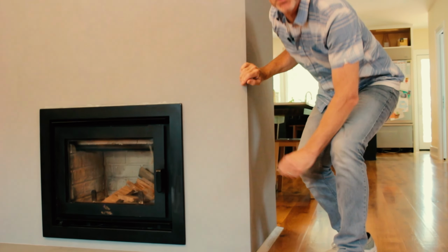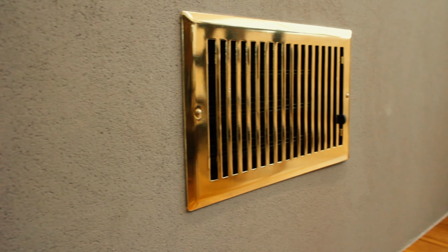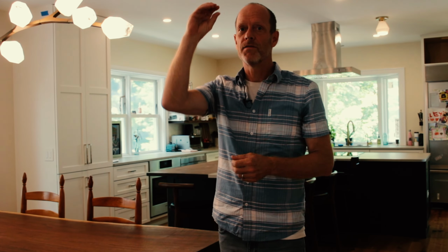Let me bring you into the other side of the room to show you the chimney venting. So the fireplace manufacturers recommend that you allow your chimney to exhaust the hot air that builds up in it through your roof. I decided not to do that. Instead, I created a pressure boundary by sealing the chimney to the flue. So the heat now builds up in my chimney. I installed vents on the chimney itself that allow air to draw in on the first floor, and there are exhaust vents on the second and third floor that allow that heat to get up into that area. I have a separate handler in that area, and that handler can distribute that heat around the rooms and make it really comfortable. So I can heat my entire house with this 65% efficient wood-burning fireplace without using any electricity.